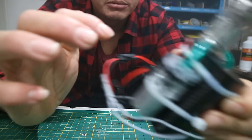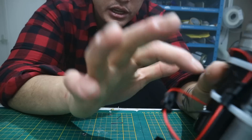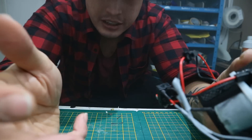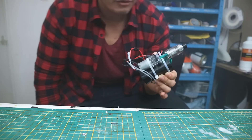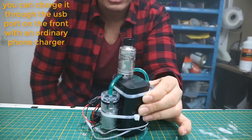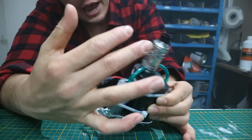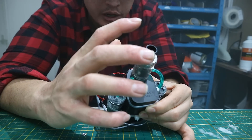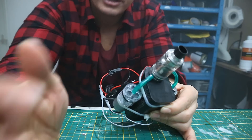So if you ever want to cosplay the Titanic, this is your ticket right here. I do know that because I plugged both air pumps directly to the main battery, it will always say 'weak battery' because it thinks it's draining really fast. The circuit board detects a dip in the battery voltage and thinks it's low, but you can still keep pushing it — you'll see on the battery levels when you actually do need to charge it. The same goes with every LiPo: do not drain these completely. Also do not use this for five minutes in a row — these atomizers are made for vaping, not for use as a smoke machine, so use it accordingly.